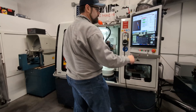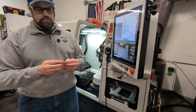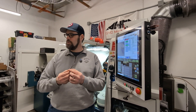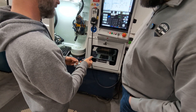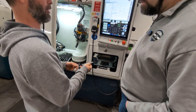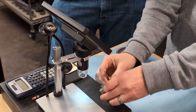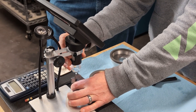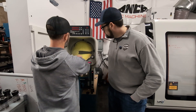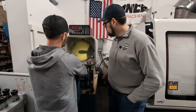With the regrind complete, we can go ahead and pull the blank out of the collet and do our final inspections. We'll be checking the final diameter as well as just inspecting the edge for a clean shear. So 125.5 — that's good. Because if that wheel starts breaking down, that core is going to grow. I just inspect all this, make sure it looks good, and look at the end work. As you can see, Cody uses multiple methods to ensure that the tooling is coming out to the right dimension and everything is lining up correctly. Happy with the tool job.